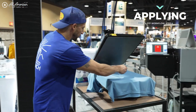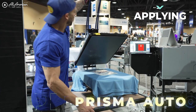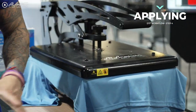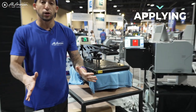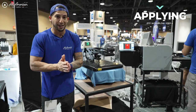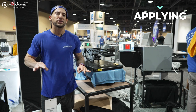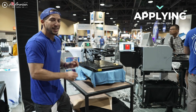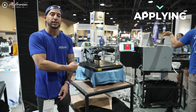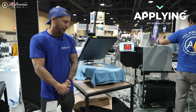Now I got my next print coming out of my machine. I've already used my resources to powder efficiently, hands-free. Now let's go to application. We're going to go ahead and position this here. And with my AA Prisma Auto Press, I can go ahead, step away, and continue manufacturing and production. I don't have to worry about any burns, scorching, or overcooking. I don't need to return back to my machine. Auto heat presses are a great way to increase your efficiency as we don't have to run back to the press as soon as the timer is done. The release is going to open in a nice, smooth, controlled manner.